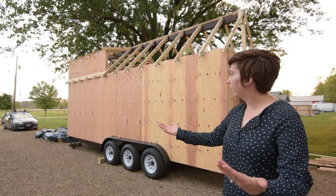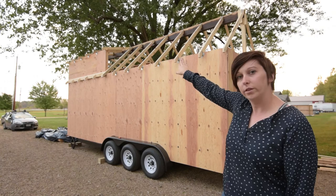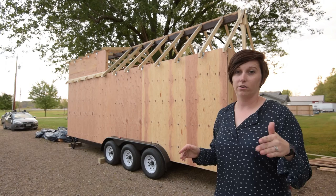That's all for this time — the roof rafters are up. Next we'll sheathe the roof from front to back, then build the cheek wall between the dormer and the main part of the house, and continue sheathing the dormer section. That'll be our next video. If you've liked these, please give us a like and subscribe on YouTube. You can also follow along on our blog at tinyhousephotographers.com — thanks!